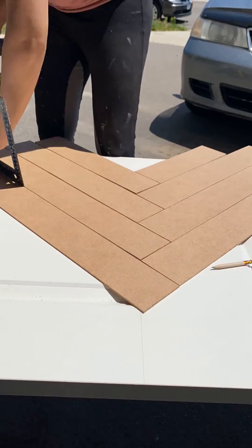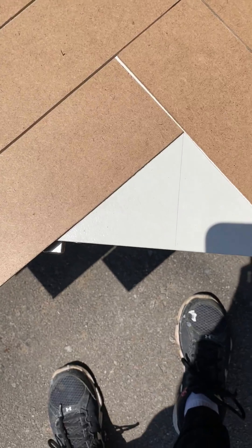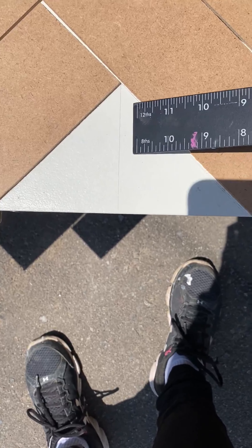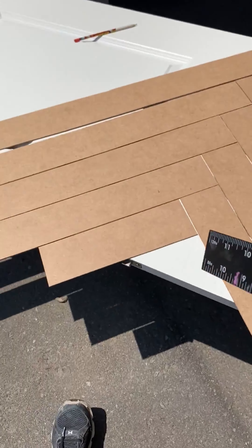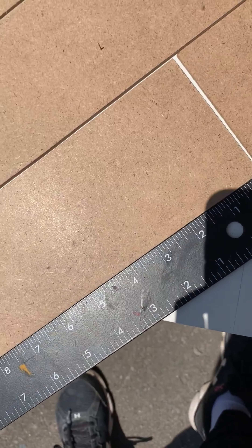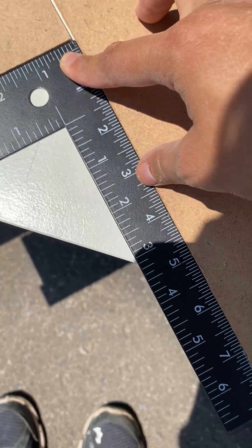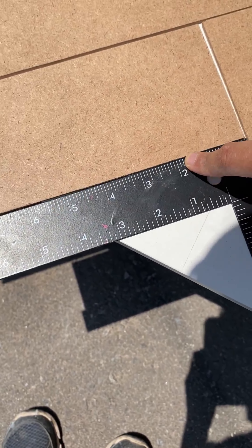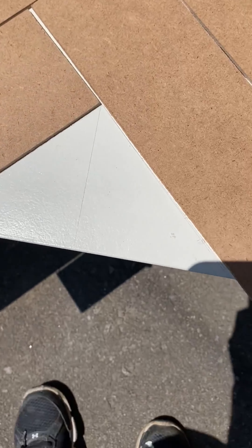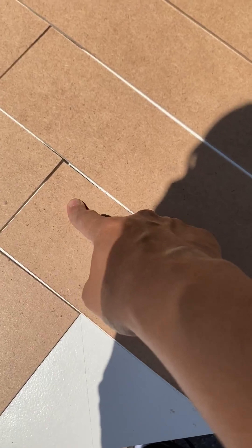Let me recap what I was doing. Now that I've got the hang of it, I'm going to show you how it's done. You need a starting point. The first thing you need to measure is the center line, and you draw a line all the way across your door. My door was 80 inches, so I drew a line at 40 inches. Next, you need a speed square, and what you want to do is mark a triangle where two sides are the same length. I went five and a half inches on each side, then marked that. That's where your first piece will go, and every single one will go off of that. Make sure you measure it accurately.